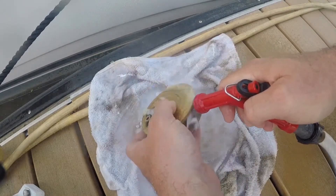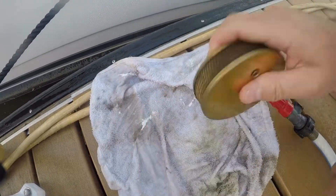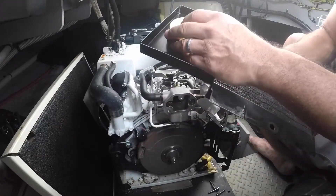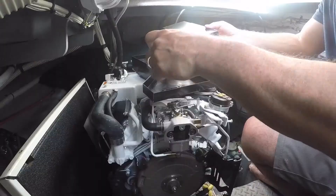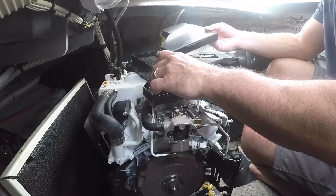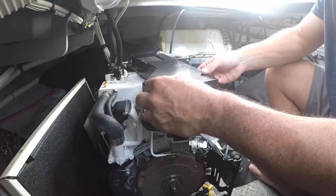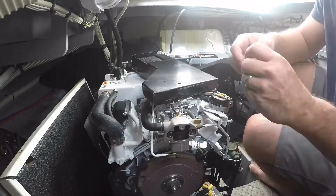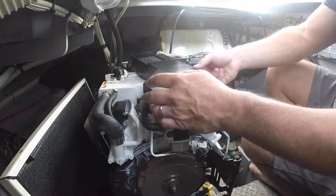Then make sure it's completely air dry before you install it back on the carburetor. Putting the flame arrester back in the housing and getting everything lined up was the most difficult part of this project. You need to line up all the holes completely and then get the screws inside before you attach it to the carburetor. Then install the whole housing as one piece.